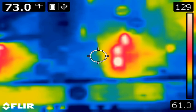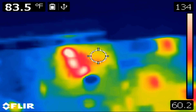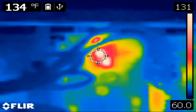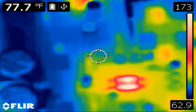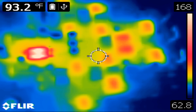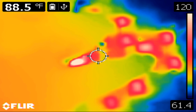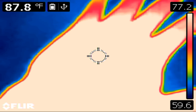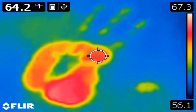We can see that those three transistors on each channel are operating. This is going to be a fun tool. It'll take a little while to get used to because the resolution isn't so great, but it's better than nothing. So many times I wished I had this when I was troubleshooting — it should be very easy to identify a short or a problem area. Right there is just an array of op amps. The cool thing is it really holds heat wherever you touch — it shows a handprint that'll stay there for a few moments, which is pretty wild.